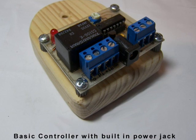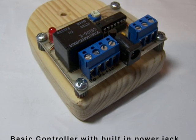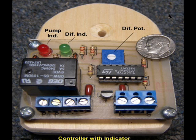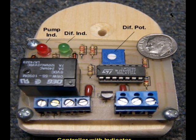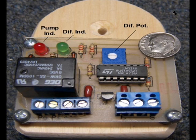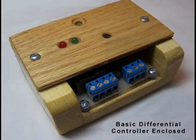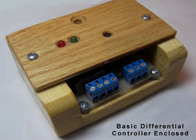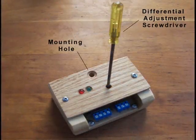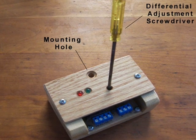Notice the adapter jack used to simplify the DC supply connector and the LED used to indicate when the pump is on. An improvement on the basic controller design was inspired by one of my customers who expressed an interest in dual indicators. The red LED comes on when the pump is activated and the green LED indicates temperature difference. It grows brighter as the difference in temperature between collector and storage increases. The basic differential controller we'll be assembling today is based on the dual LED indicator system modified for an enclosure. The pump on and pump off temperature adjustments have been integrated into one simple pot adjustment that may be accessed through a hole in the enclosure.